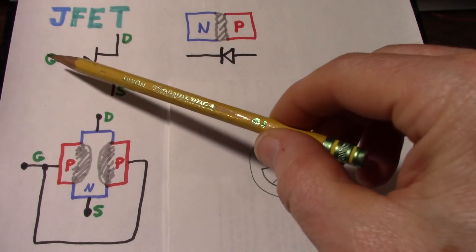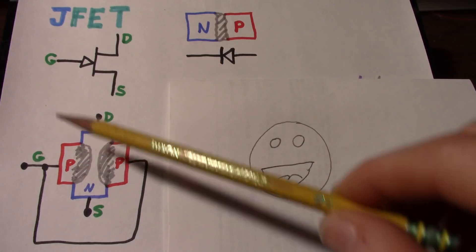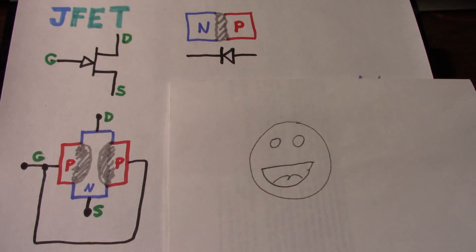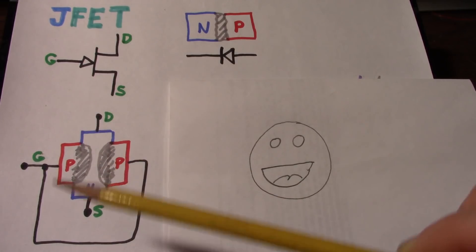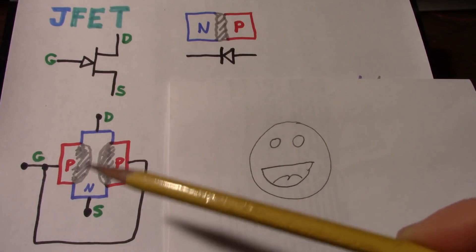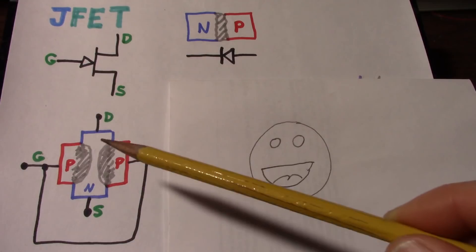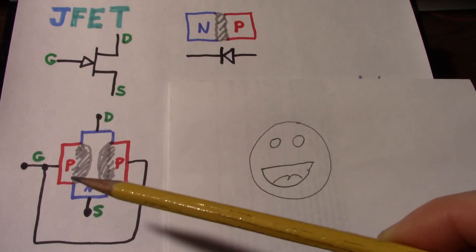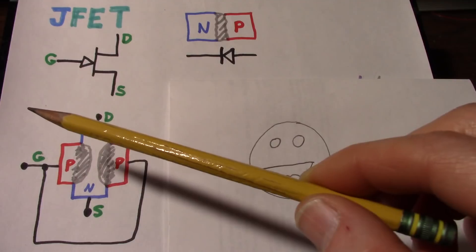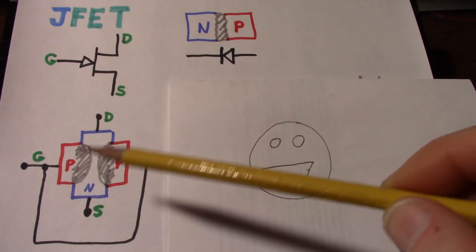What's interesting is you have to use a negative voltage on the JFET to turn it off. At zero volts, you're allowing current to flow. That might seem like a problem — where are you going to get a negative voltage? Well, if you play around with tubes, you already know how to do that, and we'll look at that momentarily. In a way, these operate similar to tubes, where the more negative the voltage on the grid — or in this case the gate — the smaller the current that passes through the device.